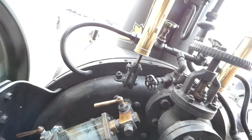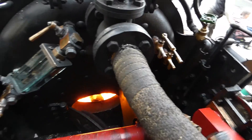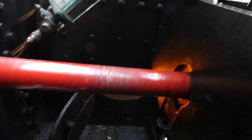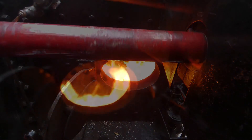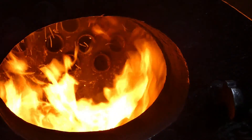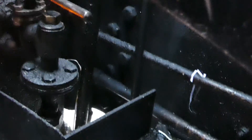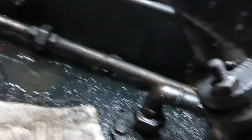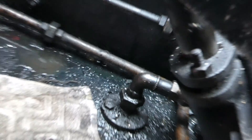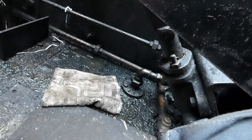You've got a water gauge which shows the water level in the boiler. Looking down, that's the fire hole door — you've got the back head of the fire box. Here we can see the tubes that run through the boiler; these transfer the smoke and the heat through the boiler tube, which transfers the heat to the water above. Here we are having a look at the feed pump — the valve that you can see on your left is the clack valve.